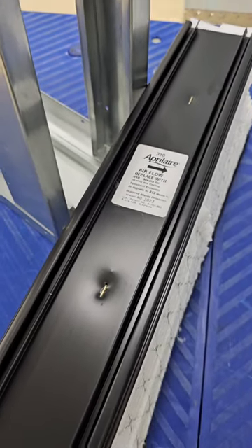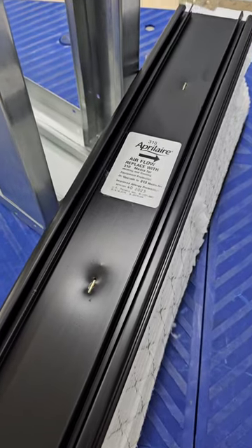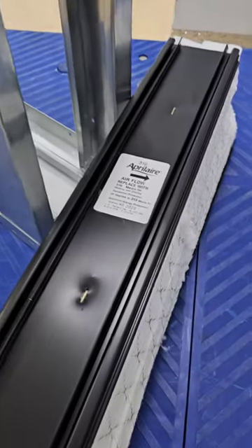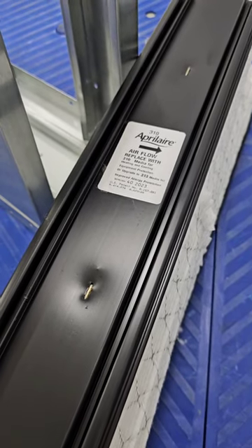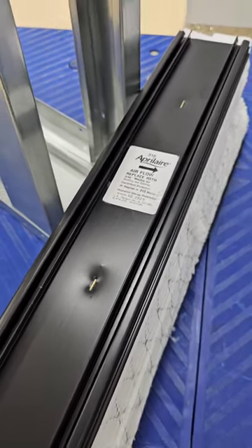The other day I put out a checklist regarding a good, well-done heat pump install, and part of that was a deep pleated filter that included a cabinet where you could minimize any sort of air bypass, which minimizes debris bypass that gets stuck on your indoor coil. This rings true for air conditioning as well, but the post itself was based on heat pumps.